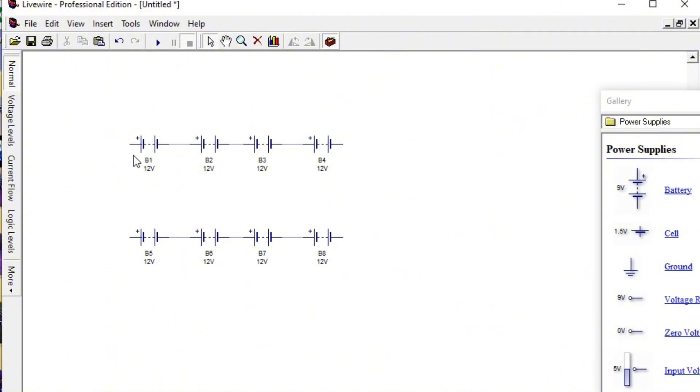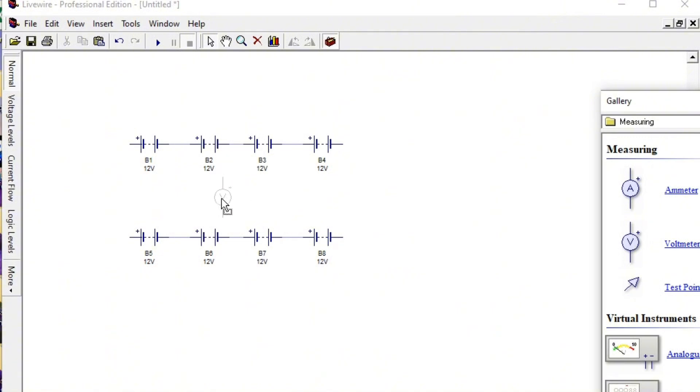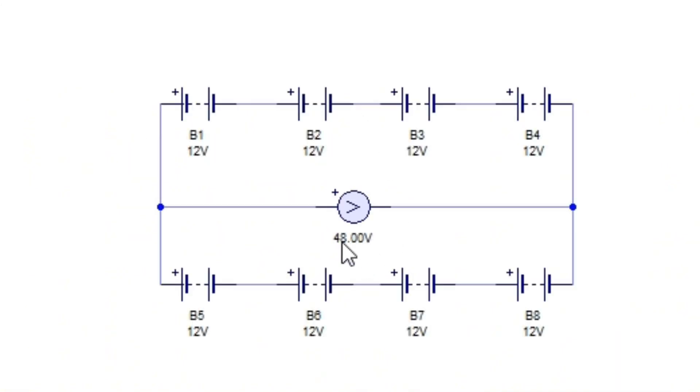The output of this series string will connect to the output of that series string, and then in the middle you connect them to an inverter. Since the inverter is not here, let's just connect our measuring device — the voltmeter. We bring in the voltmeter, since positive is on the left we rotate it to the left. The negative output here we connect, the negative here we connect at this junction point. The positive we connect here. When you simulate you can see that 48 volts is coming out. So irrespective of how you connect your batteries: in series the voltages are additive, in parallel the voltages are constant. Even if you want 16 batteries for a 48 volt system to increase storage, you collect them four by four into four strings, then positive to positive, negative to negative, and you still get your 48 volts.